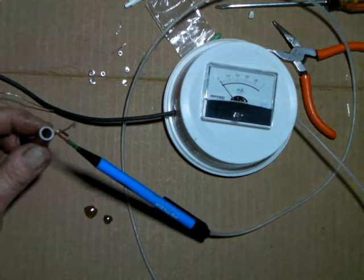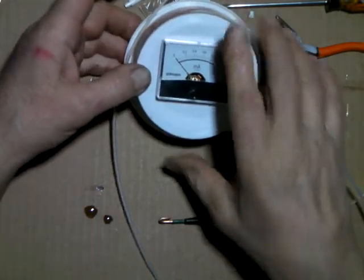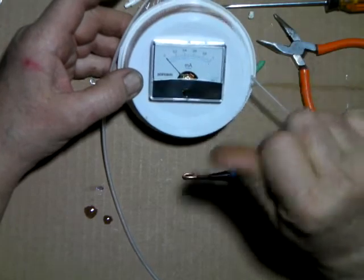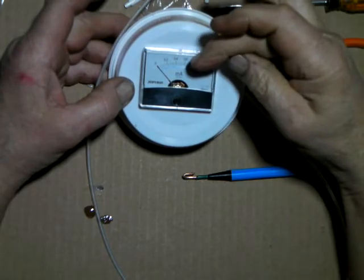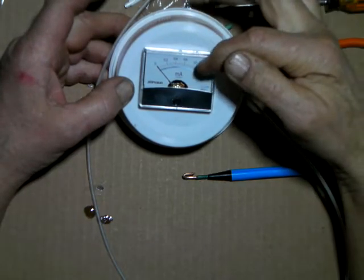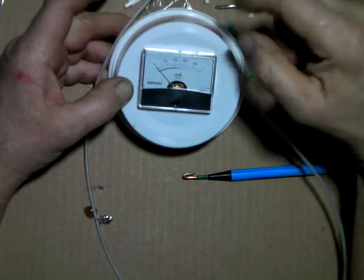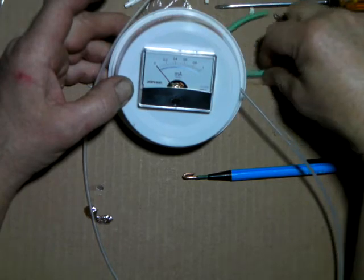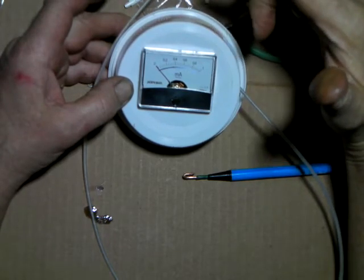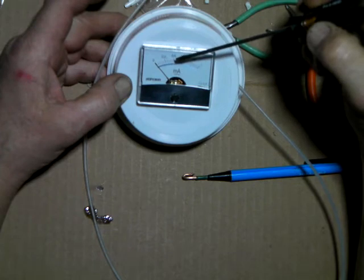So again, with these 5 1 meg resistors, the 2 is going to be 1000 volts, the 4 is going to be 2000, the 6 is going to be 3000 volts, the 8 will be 4, and the 1 5. But like I say, more than likely you're not going to see much more than maybe mid-scale. That's about what you want. And when you dial in voltage for a 4CX250, we're going to want it hovering just right over that 4 mark, which will actually be 2000 volts.